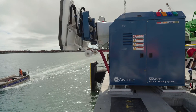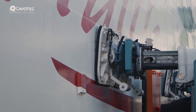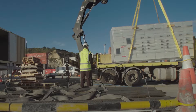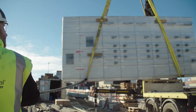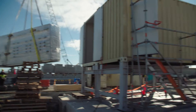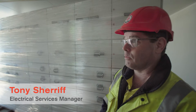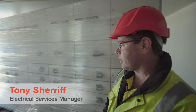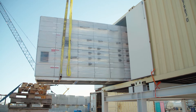MoorMaster is a state-of-the-art mooring system that will allow us to berth ships faster and safer. This is our new switchboard — we've had this one made by Kinetic Electrical; they've built it and brought it in. It's about 1600 amps rated, so it's quite substantial, and 36kA fault current rated, specifically designed for this install.